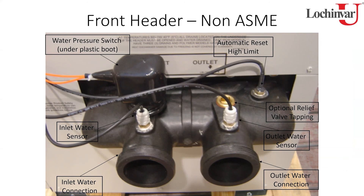The bypass works like this: as water enters the heat exchanger, only a portion goes through the actual tubes — the rest is bypassed. That portion going through the tubes gets superheated, which keeps the flue gases above the dew point and prevents condensation. The bypass is spring-loaded; a plunger depresses against the spring proportional to flow rate, diverting cooler water from inlet to outlet. The superheated tube water mixes with the cooler bypass water, resulting in a manageable outlet temperature — typically a 10 to 14 degree delta T between inlet and outlet connections.